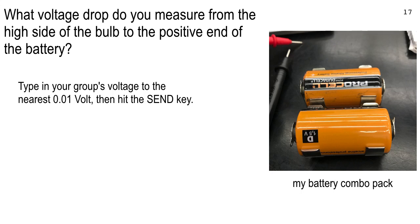Is this you guys over there, Rashid Harun? 0.59? All right. That's not Rachel, that's not you, is it? 0.59? All right. So that might be a weak battery, but everything else is near 1 volt, plus or minus about 0.1, 0.2. I would mark that off on a test. This one I would say, let's try it again. Let's measure again. Whoever that one was, 0.16.